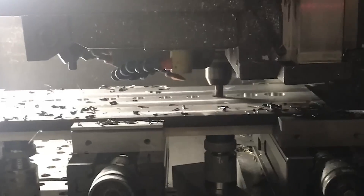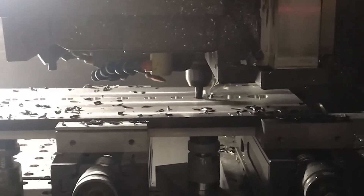Alluro turned to the new Harvey 1TE end mill to eliminate that tool change. With the Harvey 1TE, the shop was able to plunge at a 30 degree angle, creating a 21mm hole, and then used circular interpolation to open up the rest of the hole to 35mm.